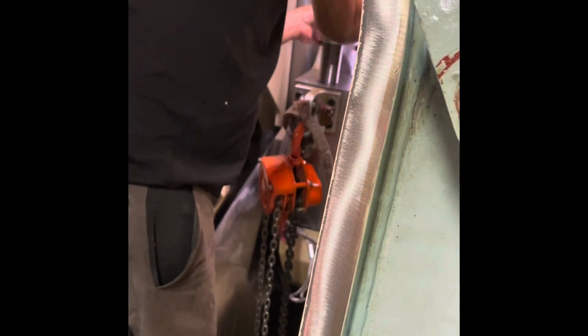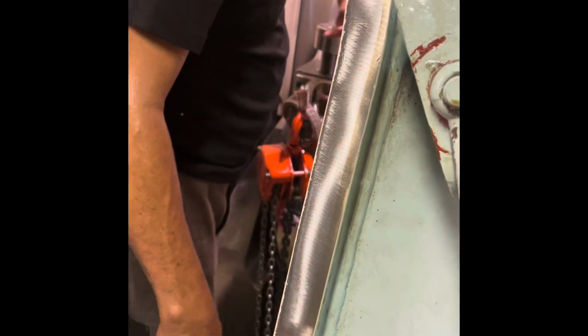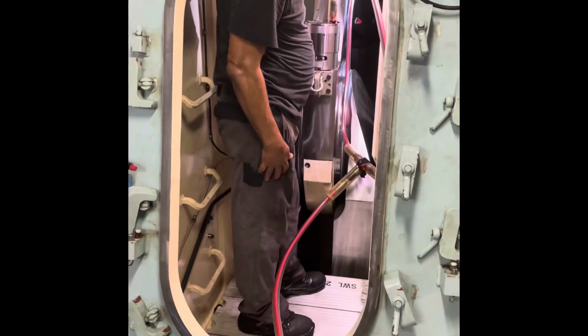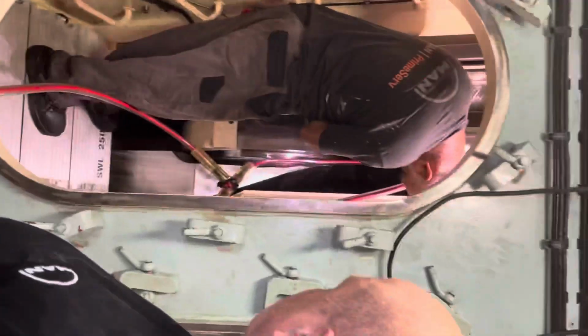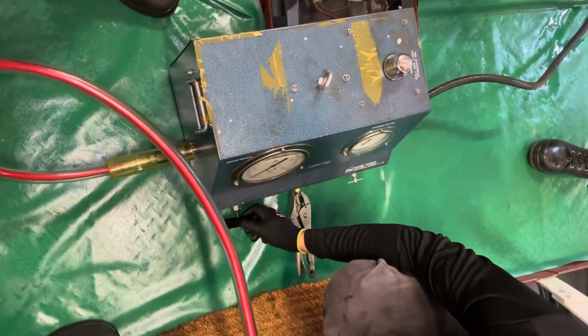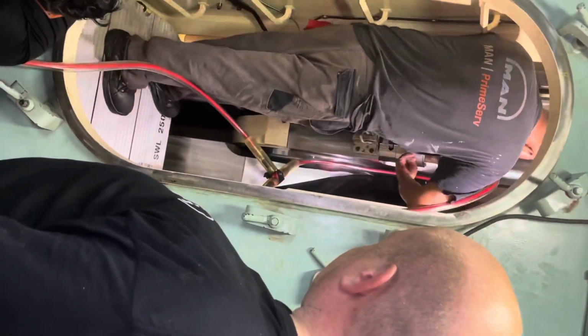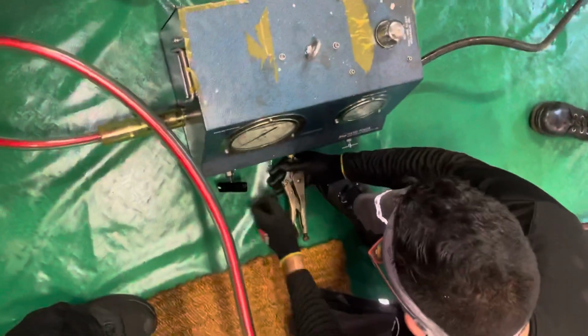Once the lower bearing has come up, put back the crankpin bearing bolts and then connect the hydraulic jacks and increase the pressure to 1500 bar and tighten the two crankpin bolts on both sides. Please note that here tightening is done in two steps to avoid the hydraulic jack piston moving too much. For a detailed explanation on the hydraulic jack tightening procedure, see my videos.